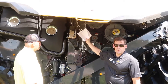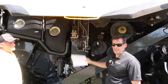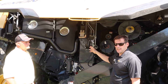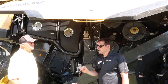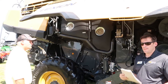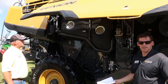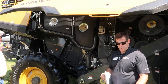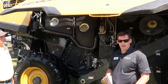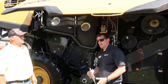As the crop runs through the rotors — they're 13 feet 9 inches long — any grain that's left is going to get threshed out very gently and efficiently all the way back. From there it drops into our chopper, where that material is sized up and spread out evenly across the field, which makes decomposition better, works it into the ground better, and makes planting in the spring that much easier.